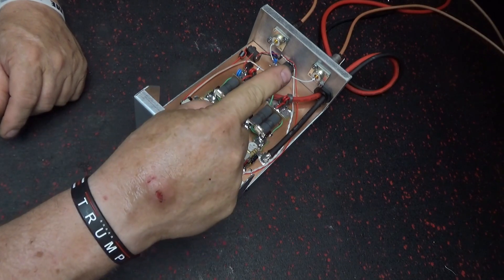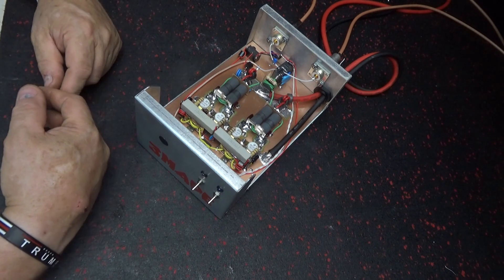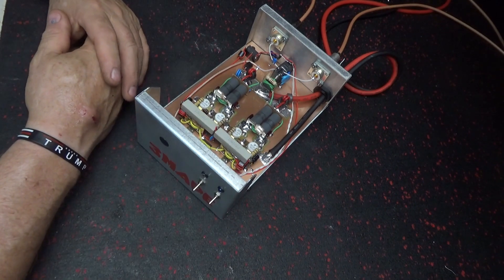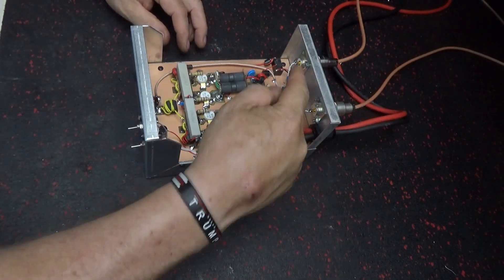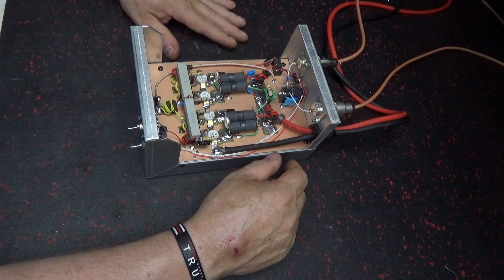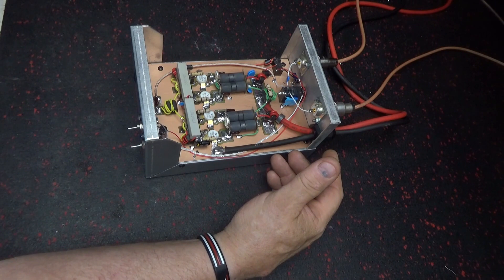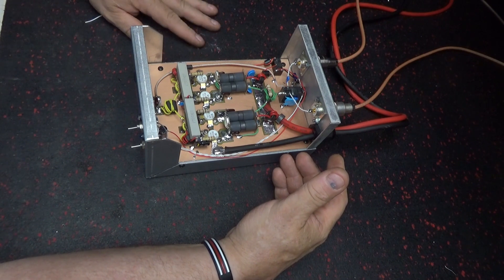And it all came down to that little diode right there — so you've got two going in together. The power came back up through there and came out and hit that LED. I was thinking it was feeding back through the switch or something. I just wasn't thinking, but when I finally thought about it, it hit me — I said, why don't I just add a diode there? I did, and it done it. A diode lets voltage run one way — think about it like that. It's good to have voltage running one way sometimes, but it also drops a little voltage too. You've got to remember that.